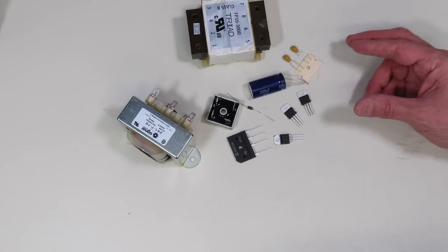For a variable positive regulator, I'll be using an LM317, a classic regulator available in a TO220 package. It can output from 1.2 to 37 volts with a maximum input voltage of 40 volts, and is available in packages with current capabilities up to 1.5 amperes. It has short circuit and overheat shutdown functions. In addition to the voltage regulator, you'll need two resistors to adjust the voltage output level. In the TO220 package, the tab is connected to the output, so again you cannot use a grounded heat sink without an insulator.